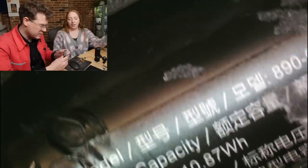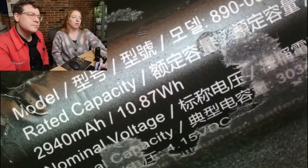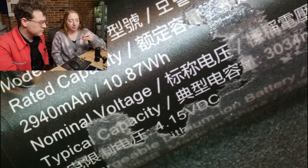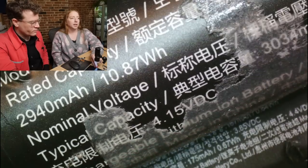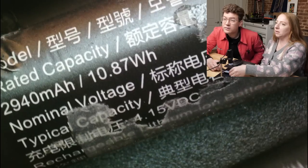Let's look at the parts from the battery case, which are also pretty fun and interesting. The battery from the case looks like an 18650 — maybe a little short, but very similar. It's almost 3,000 milliamp hours, compared to the 175 milliamp hours in the glasses themselves. So if you divide this by that, you can charge the glasses many times from the case.